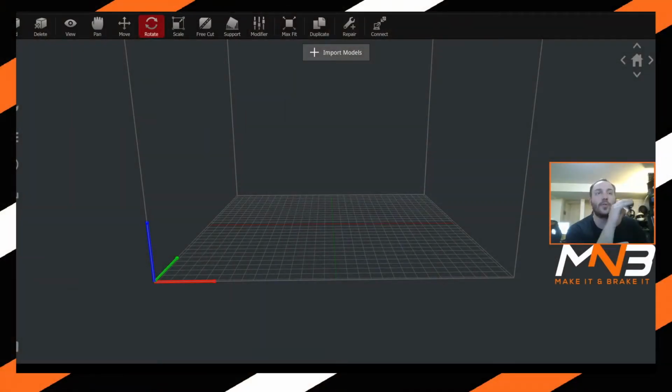Okay, everyone. So we're in our slicer. This is IdeaMaker 353 or something like that. And I wanted to show you the adjustments I had to make in here so that we can get the maximum print volume possible out of our Raise 3D Pro 2 Plus. This adjustment applies for models that have very large bases that push you out to your maximum capacity or close to it, or models whose print volumes are at least close to the 12 by 12, such that if you're using supports near the edges, it can screw with your platform additions for those supports.